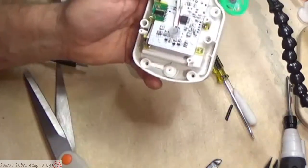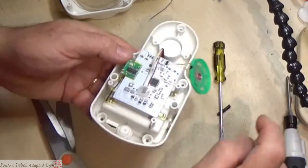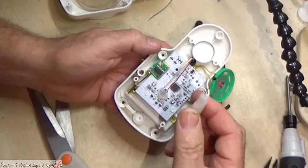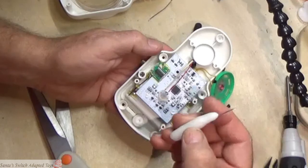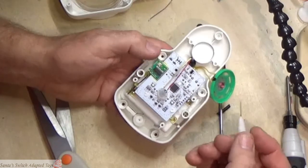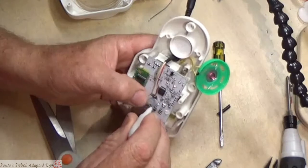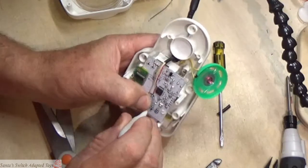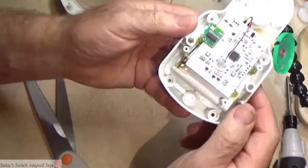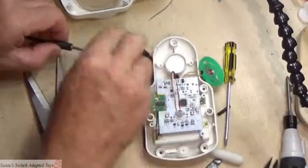One of the goals I have on all of my switch adapted toys is that they will function as intended from the factory. So we need to push that back down, and those things are hard to push in on their own. I've taken a paper clip, bent it out straight, and wrapped it up in a homemade holder — makes it easy to use. Those switches in the center have a hole on each side, and if you use that tool you can push the switch back down to the circuit board.